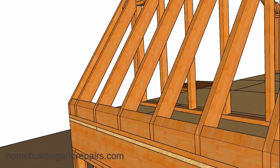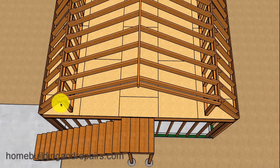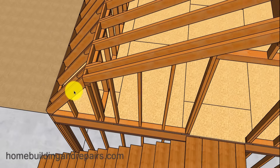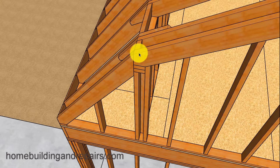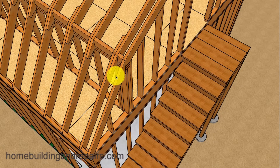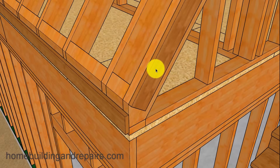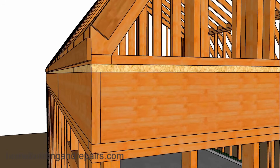Now let's take a look at how we finished off the rafters on this side, along with our exterior wall with our doorway in it. We are going to be framing the roof a little differently on this side, where the two rafters will not be lapping. Next up, we are going to be installing a 1x4 around the perimeter edge of the gambrel style roof to provide us with an overhang that we will be able to slide our siding or stucco lath paper, along with the netting and finished stucco, to create a waterproof or at least water resistant transfer between the roofing and the wall finish.